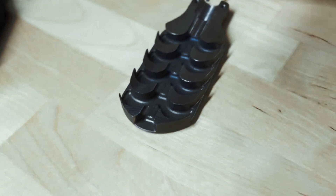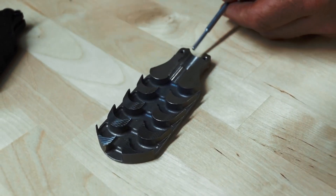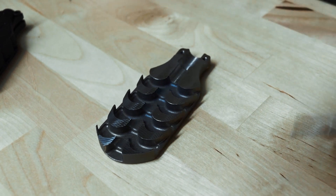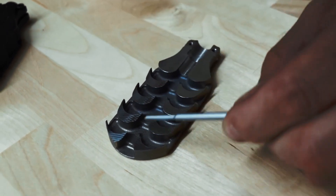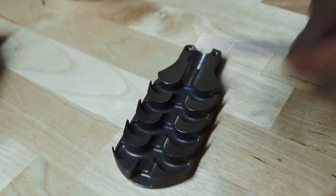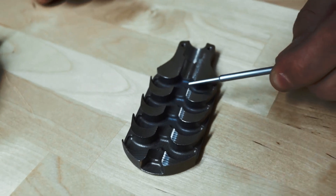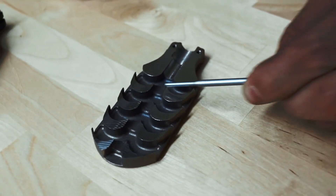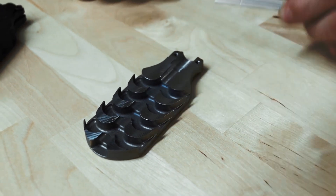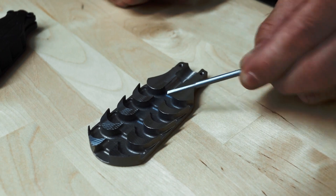Here we're going to talk about what makes it work. As we see here, the brake is bisected. We have a half-28 thread, which is your standard thread for AR-15. Looking inside, we have two different radii outside of the center bore line: an inside radius which is fairly steep, and then a longer bearing surface — a longer radius — on the leading edge.